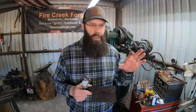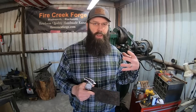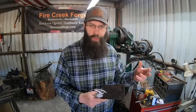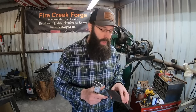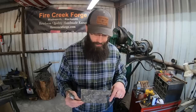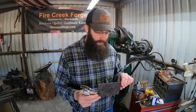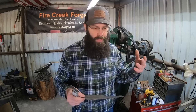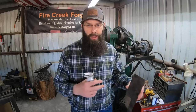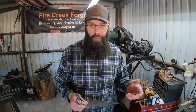So I'm not going to delve into further heat treating processes that could take care of that issue. My other two options, at least at this point, are to either leave it much thicker with a forged finish, or my third option is to forge it thicker and then grind it to the thickness I want, which will obviously remove the forged finish.